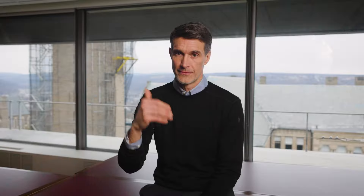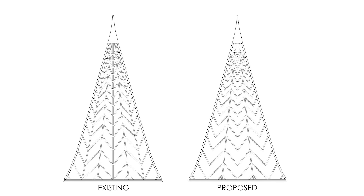Water through the years has gotten in below the lead coated copper roof. Counting in from the corners of the tower roof, there are five vertical battens and those are intersected by diagonal battens. Each time there's an intersection of diagonal battens to vertical battens is an opportunity for water to sit. Due to the severe deterioration of the roof at those batten intersections and of the overall sheet material, it became an urgent need to replace the roof.